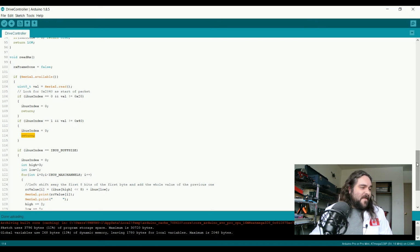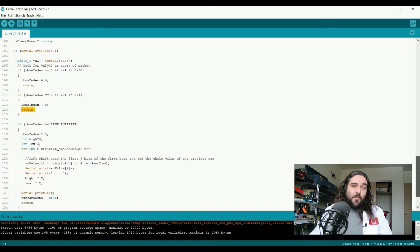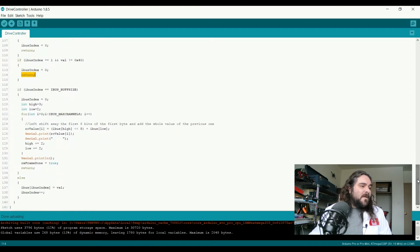Assuming that we do have a valid header, or we're not looking for the header at this point, if we are at iBus index of greater than 1, we're no longer looking for the header. We look to see, are we at the end of the buffer size? Do we want to stop reading at this point and update all of our channels? If we've hit the 32 bytes that this buffer is, we set the iBus index back to 0 so that when we're done, we go back to the main loop of the program and we start looking for the header again and find our next packet window.